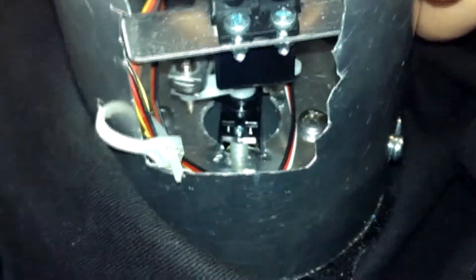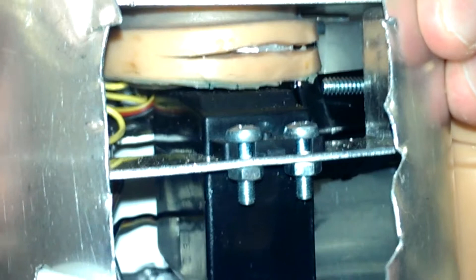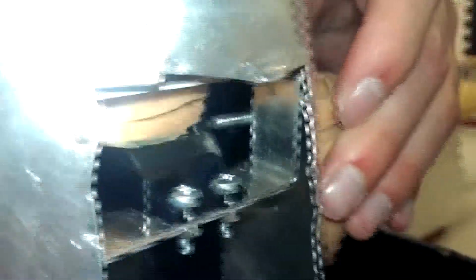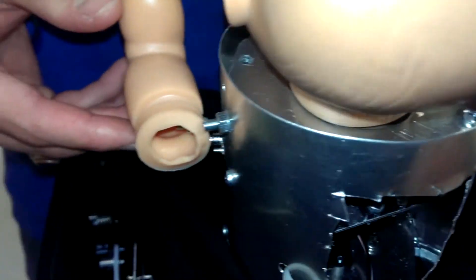There are a total of five servo motors mounted inside the doll. The first servo operates the chest opening and closing. The second servo is a continuous rotation servo that controls the rotation of the head, attached via a metal plate, with additional slack in the wiring for this action. Each arm is directly attached to a separate micro servo that controls movement up and down. Since each arm has its own dedicated servo, they are able to move independently, making the doll seem more life-like.